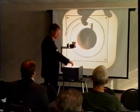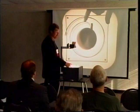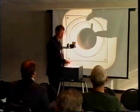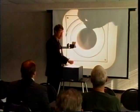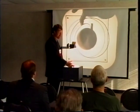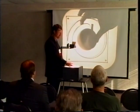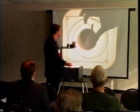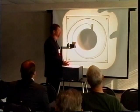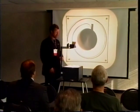And of course, then it's a matter of coming from a situation like that, and a lot of people will try grabbing, when they're adjusting hairsprings, they'll grab and twist as opposed to just a nudge with one edge of their tweezer. Since the hairsprings are delicate, I'm always an advocate for touching as opposed to grabbing. So I just wanted to mention that.